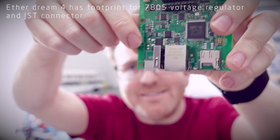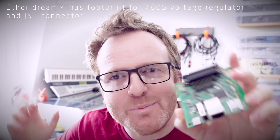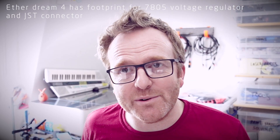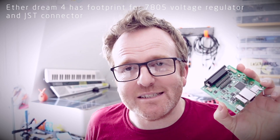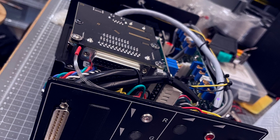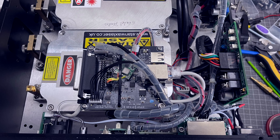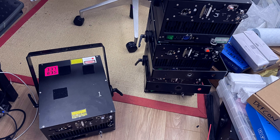One socket is for RGB and the other is for X and Y scanners. The other thing you want to do if you install this inside your laser is add a voltage regulator — it sounds hard but it's not crazy hard — and that way you can use the laser's 12-volt power supply to power this directly. Then finally you need to get an RJ45 EtherCon socket on the outside of your laser and just use a little patch lead to connect into it. Trust me, I've got 40 lasers with these in and it works great.